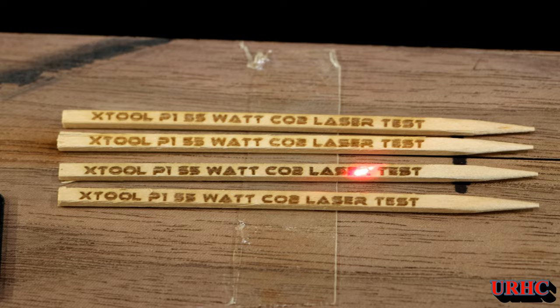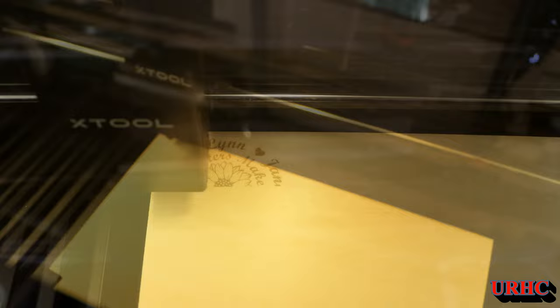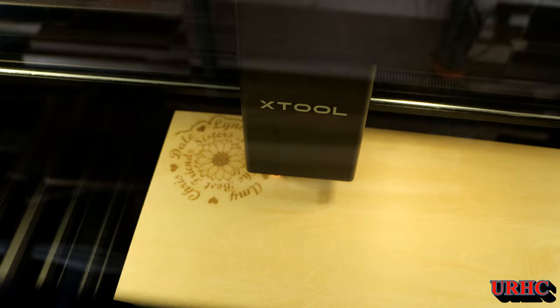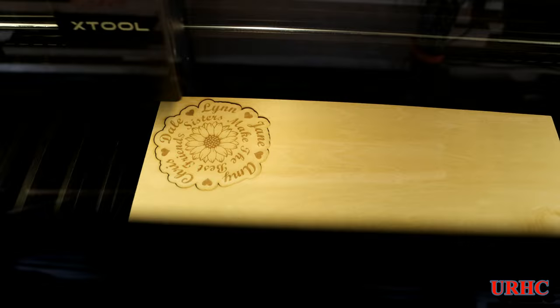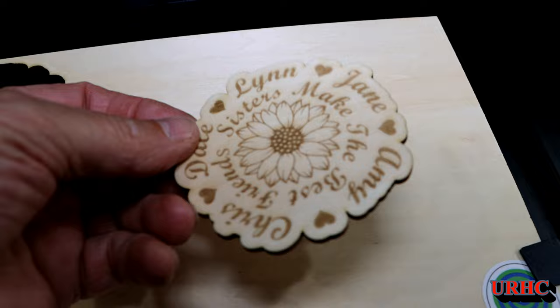The precision of those cameras is amazing with no adjustments needed — it looks like that right out of the box. Then I decided to try an engraving — one I had done for coasters for my wife. I just loaded it into Creative Space, added a border around the outside, and tried cutting it in some three-millimeter material. It came out nice just for the first try, but was a little light for my liking — that was using the factory settings.